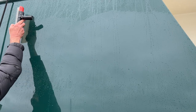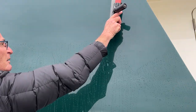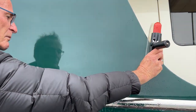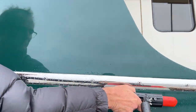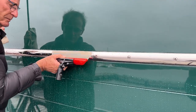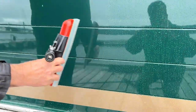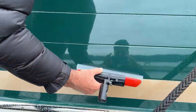Finally, washing your boat yourself provides an opportunity to closely inspect and pay attention to every detail, which can easily be overlooked. We remain mindful during every boat wash to identify signs of chafe, metal fatigue, inspecting our hydraulic hoses, hold down hardware, especially swage fittings, and painted surfaces to catch any small issues before they escalate into more significant problems. Preventing or correcting problems in a timely manner is generally easier, quicker, and far less expensive than dealing with extensive and time-consuming repairs or replacements.